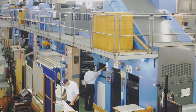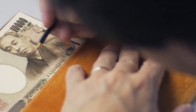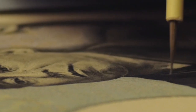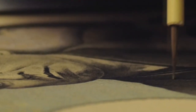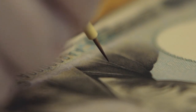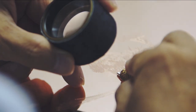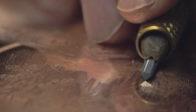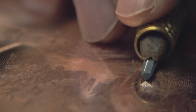Let's take a look at some of the manufacturing processes. Making a new banknote starts with creating the design. This work is done by specialist banknote designers and engravers. Using extremely fine brushes they first create the complex, highly detailed image. This is then cut into the copper plate that will be used for printing. The carved lines are so fine there may be ten or more per millimeter.